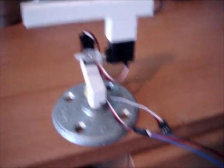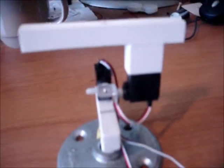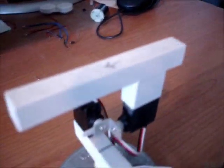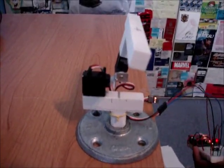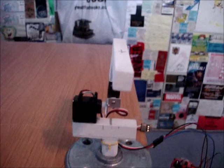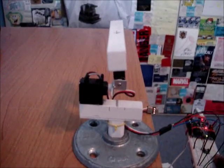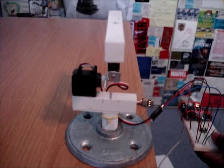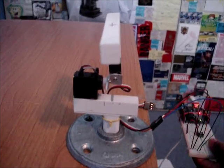You see rotation on that based on the accelerometer located here. Here's the platform, and as the accelerometer is twisted — let me get around to the other angle so you can see it easier. Here's the axis, and as the accelerometer moves, you can see that twist. It ranges from a pulse position modulated value of 1,500 being level, 1,300 being one direction, and 1,700 the other direction.